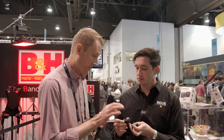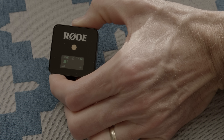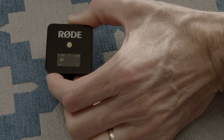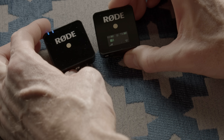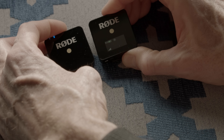There's also a very nice OLED screen giving you a full readout — battery status of both the transmitter and receiver, plus a detailed level meter that's well-segmented so you can really see the detail in the metering. You can also see the output level and link status. Pairing is very simple: the units come paired out of the box so you just turn them on and they work. If you need to re-pair, press and hold the pairing button, then tap the power button on the transmitter you want to use, and within two seconds it's paired and locked to that unit.